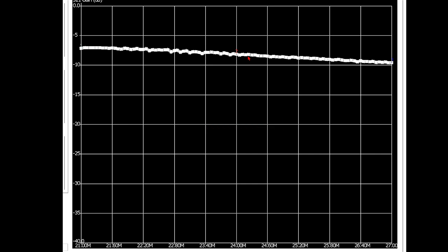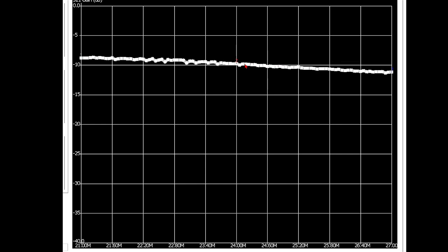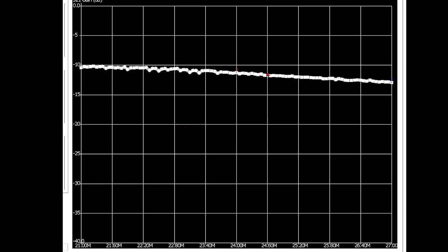That is 5 beads. Let's sweep it again — let's say 10 dB. So now we're at 10 dB with 5 beads, so about 2 dB per bead. Here comes bead number 6, and maybe 12 dB. We're going to call it 12 dB. So we're still at about 2 dB per bead.